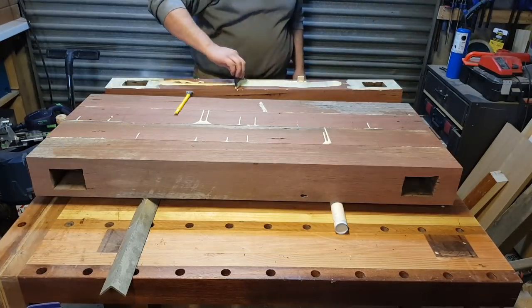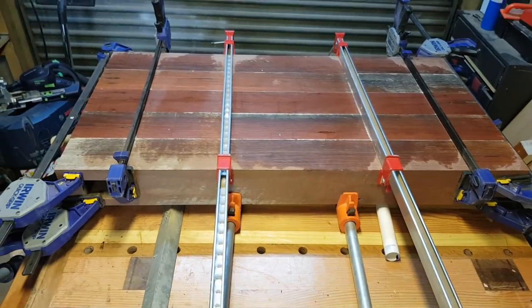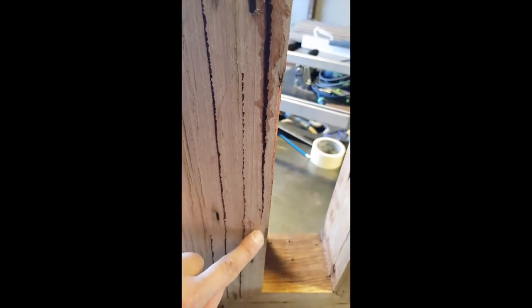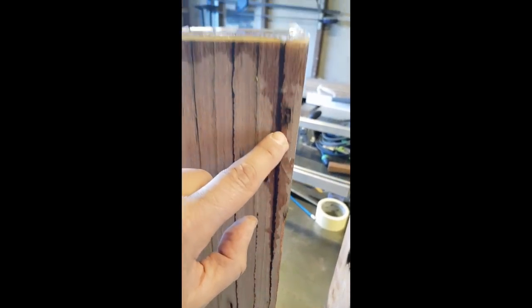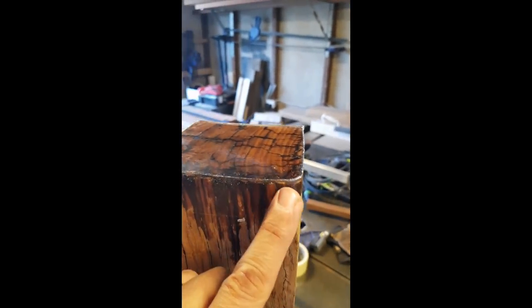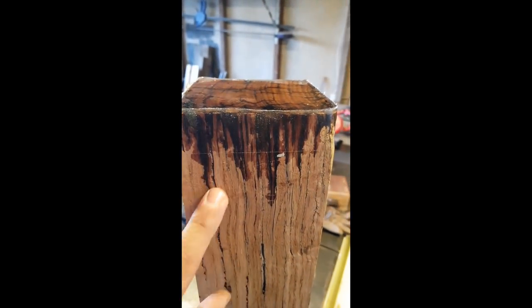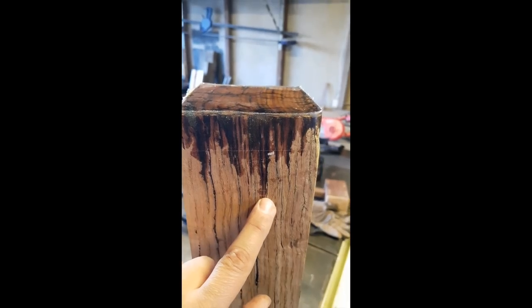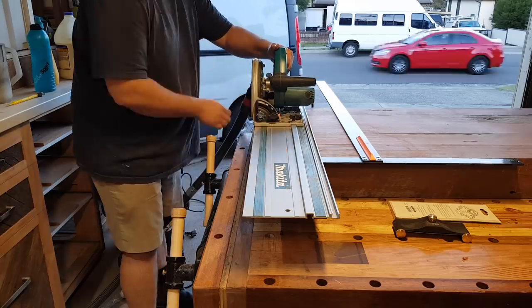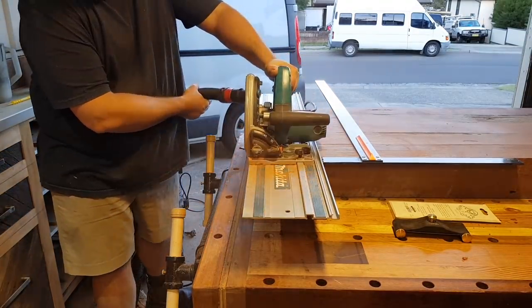Here I am gluing it up — used a heck of a lot of glue for this. These joints are ridiculously strong. That was a full delamination going right to the end of the split, which is excellent. This one here, the end grain was basically crumbling away, and the resin has certainly done its job — it's come right down to about two inches below the surface and stabilized all of that, so I can work with it now.